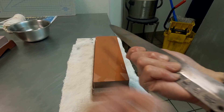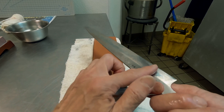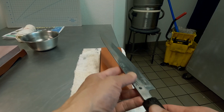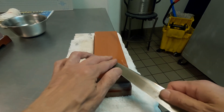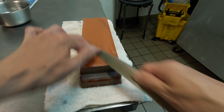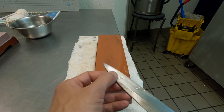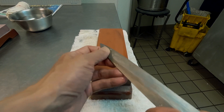Forget about what you have learned. See how I am holding the knife. And also forget about using the entire stone with one long stroke. Just grab the middle of the blade when you do the tips. And then check frequently. As Mari Kata said, observe often.